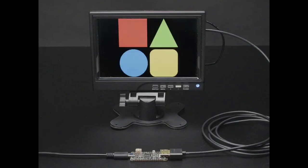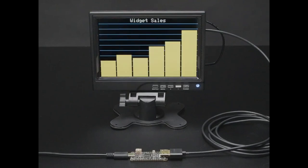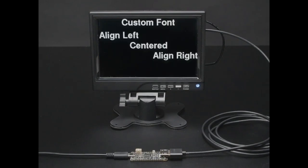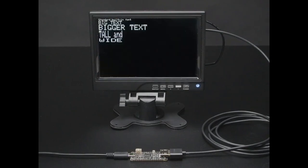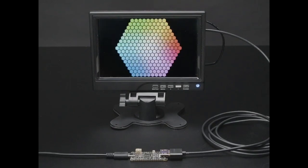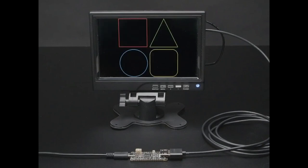And as far as the Feather is concerned, it's basically connected to a 320 by 240 screen. And that 320 by 240 is pixel doubled to 640 by 480. So, you know, the pixel is a little chunky, but every HDMI monitor supports 640 by 480. So it's a universally supported resolution. Also, we all have these dead monoliths hanging on our walls that have nothing on them. And we don't want to put something on it because it's internet connected and a bunch of nonsense and it's terrible. You can turn it into art that you make yourself. This is one of the cool things.